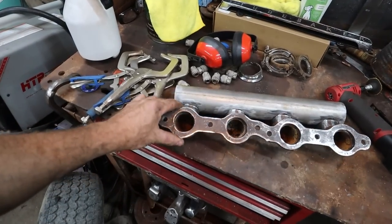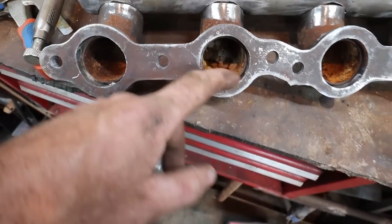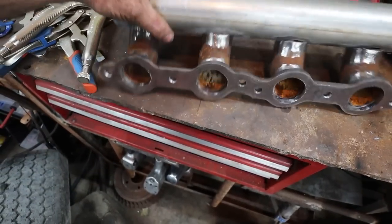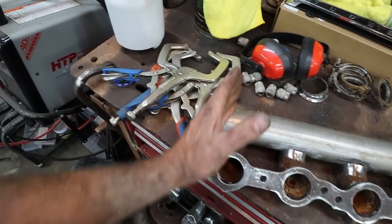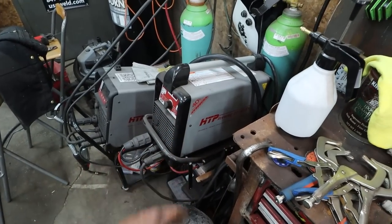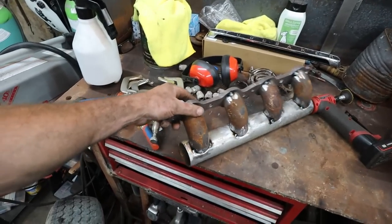Well, we're close. I thought of opening these up because these don't quite come through, which is okay because we can actually do the weld on the inside then. But yeah, I think the easiest is we'll trim that back, tack everything up. Like I say, round this, we'll do that flange down. Should work out fine. I want to try out this TIG welder. We'll give her a burn on there and see how that works with all of this.